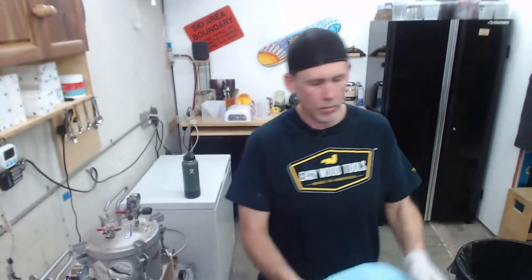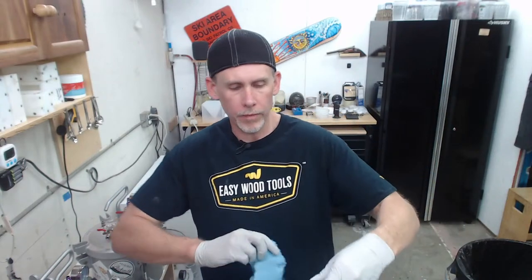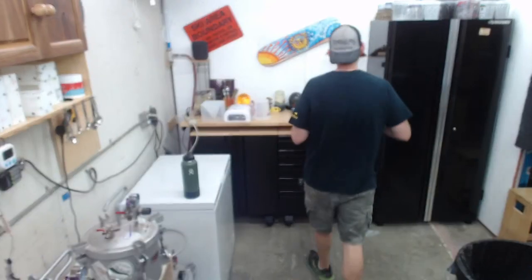Video's good, keep good notes. But simple things like what temperature was it when you poured it maybe don't seem that important, but it really is. It'll drastically change the way blanks end up turning out. And I think a lot of people will watch me do something on video and then say, oh, I tried it, but it didn't work. And a lot of times it has to do with that temperature.